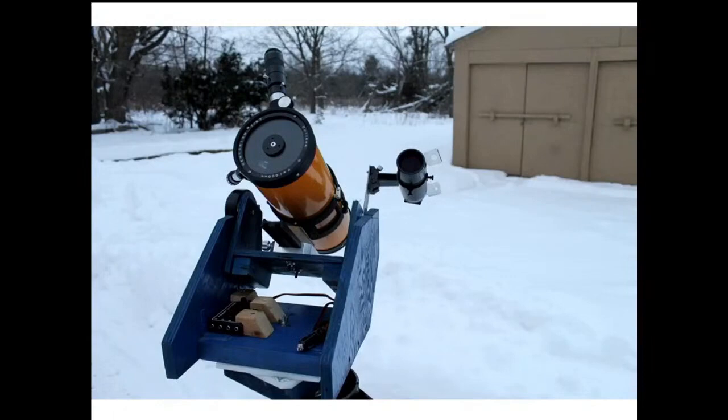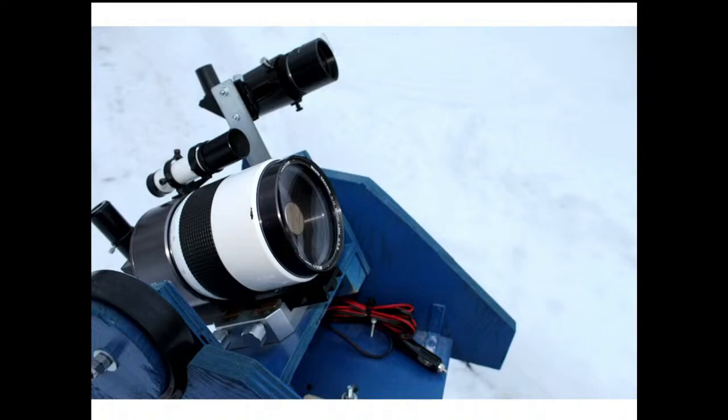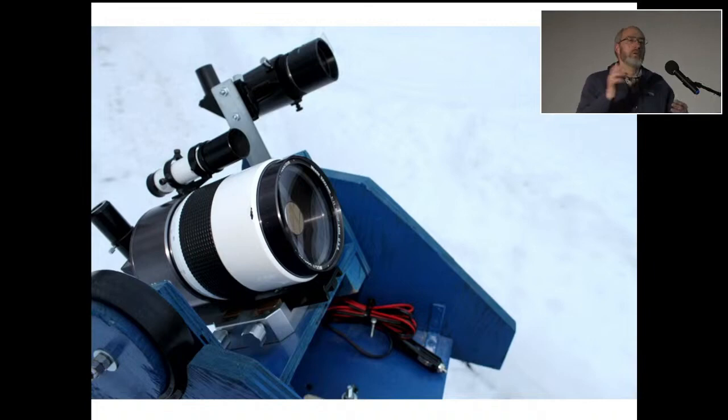You can see a better picture right here at the very extreme lower left. There's two little pads made from a slightly larger diameter pipe. That just meant cutting a piece of pipe about 2 centimeters long, and cutting off a tiny section of it, just because its radius of curvature is slightly larger than that pipe. You see that pipe, it's maybe 1 inch or a couple of centimeters wide. And I just cut a plywood disc to fit inside it. So, short answer, plastic pipe.